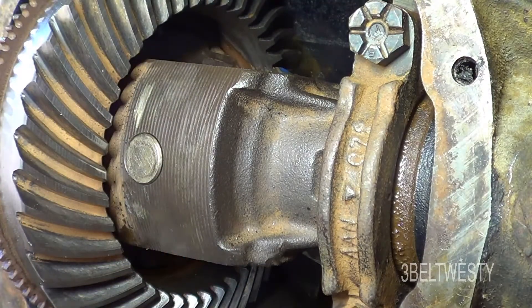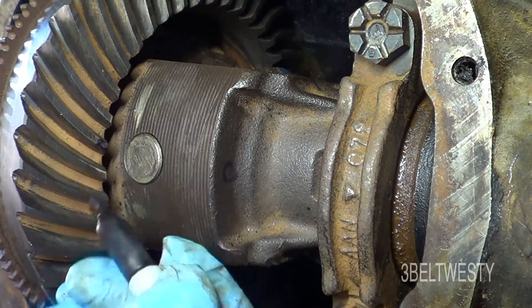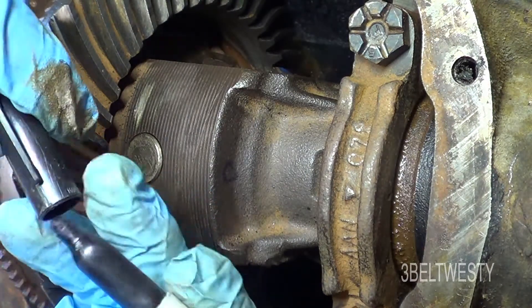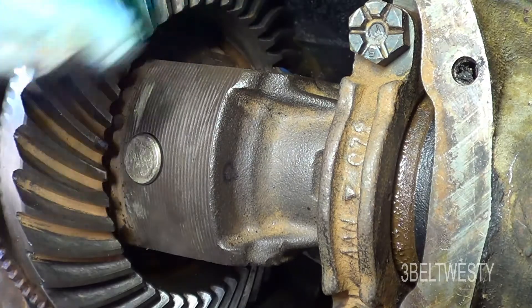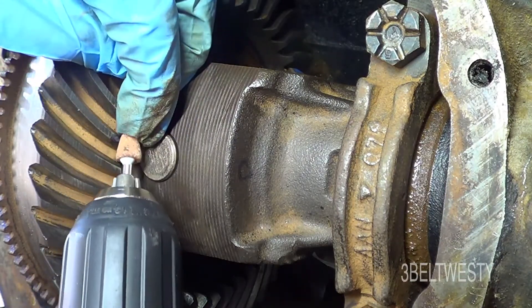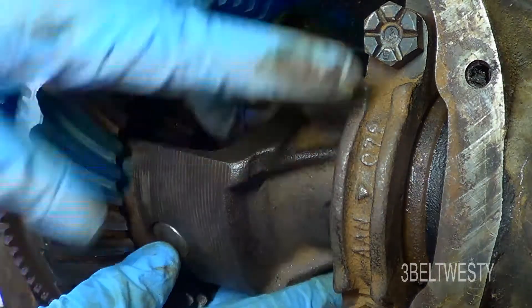It turns out the side without the hole had less material. I don't know if it's just random how this gear fits. I went through and blackened the tooth with a Sharpie, gave it a solid hit to mark contact, then gingerly took just a little bit off the end. I couldn't find my Moto tool, so I just put the end of a grinder there and buzzed just a little bit off that corner.